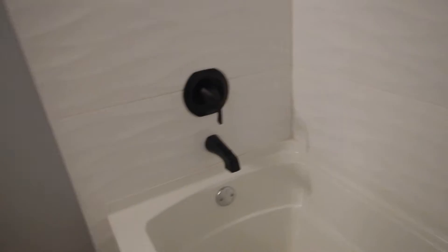But this is plumbing. The niches are level. I didn't measure this one — I can look at it and tell. But I put a level on the ones in the primary bedroom bathroom. Shower enclosure and they're level. They're supposed to be a pitch on your niche so the water rolls off of it.